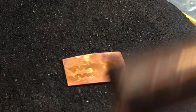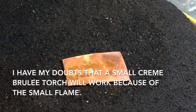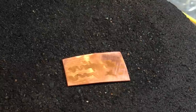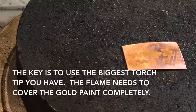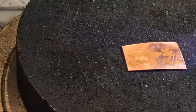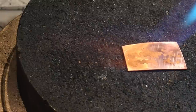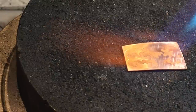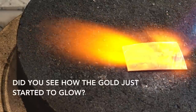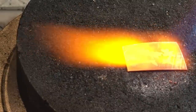Okay, we're dry. Got our Iwatani big torch head here and our butane fuel cartridge. You could use acetylene or propane. I like this big wide torch that comes with this. If you're going to use acetylene or propane, make sure you use the largest tip you have. You want to keep the oxygen out of the way here — the flame burns up the oxygen, so as long as the flame is over where we're trying to join the metals, it should work. You want to keep your pieces rather small because of this.